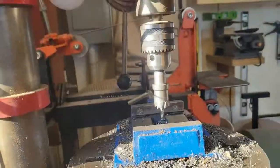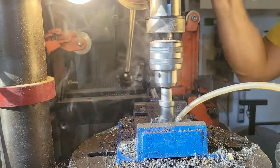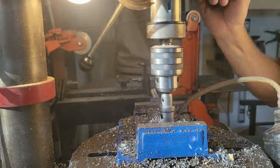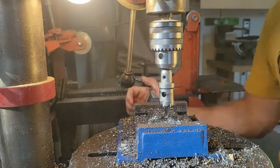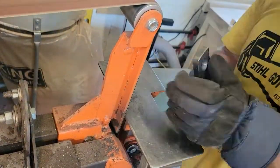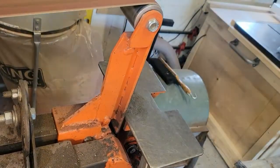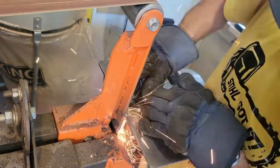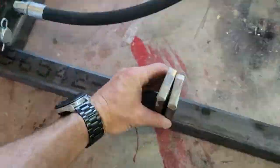Here I'm making all the collars for the mounts on the three-point hitch and the top link, as well as the adjustable three-point hitch on one side. I had to make six of these in total. The sander you see is a 2x72 belt sander that I made based off a design from Jeremy — I'll put a link in the description — and that thing has paid for itself several times over.